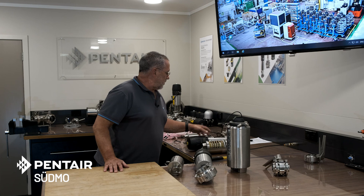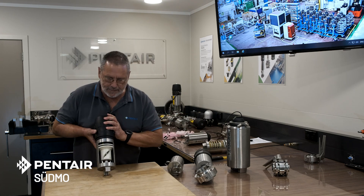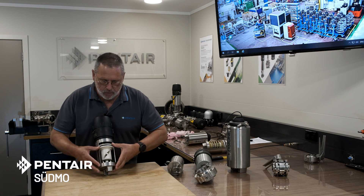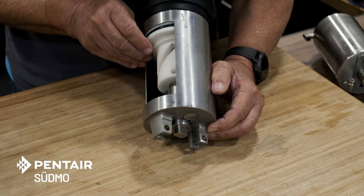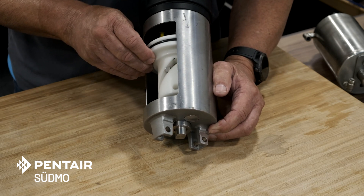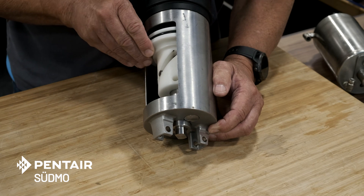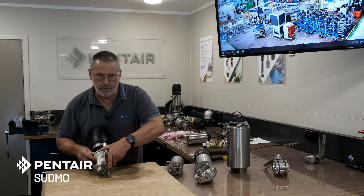Just to give you an idea of how the mechanism works, we've got a cutaway here. The cylinder piston gets pressed down by air, and as it goes down this gudgeon slides around on the groove and that rotates the shaft. Simple.